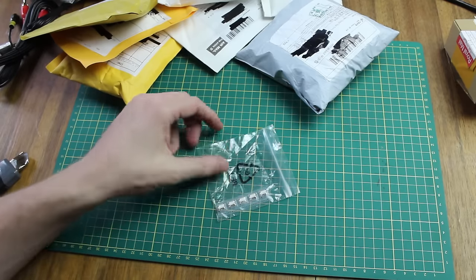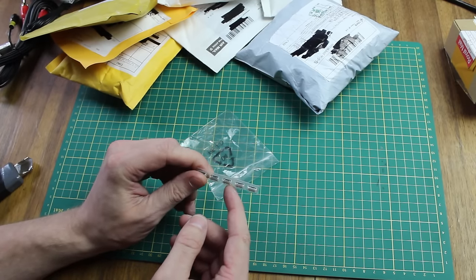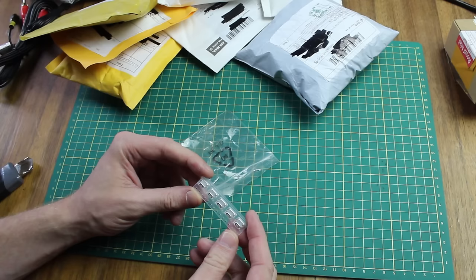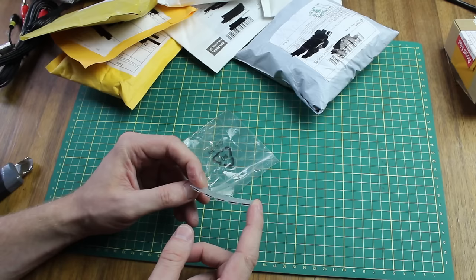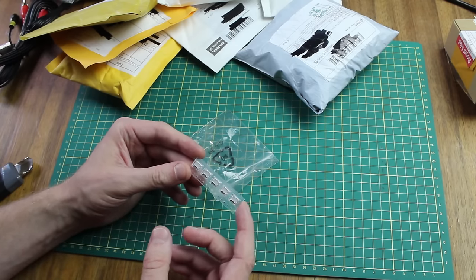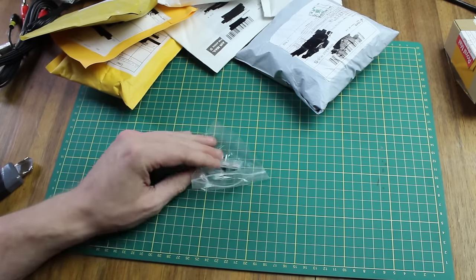A friend of mine brought me his kid's tablet — they'd broken the micro USB port, the plastic tab inside had broken so you had to wiggle the cable to get it charging. I unsoldered a micro USB from a lithium-ion charger I had and soldered it into the device, and it worked perfectly. So I thought I'd get a supply of these. I picked up the most common footprint micro USB I could recognise from most devices. They were about £2 delivered but from a UK supplier, which is why they cost more.